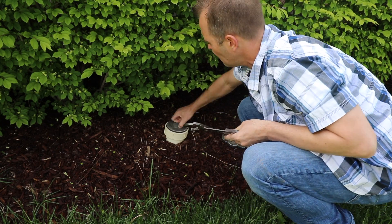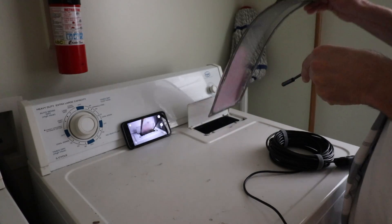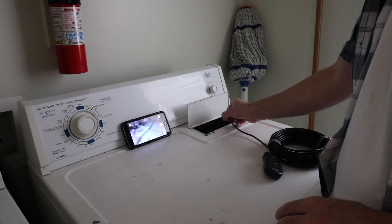This part works really well — it's a straight drop about 15 feet down to access the sewer line. If you see standing water at the bottom that means you have a blockage between here and the street; if not, it's between here and up into your house. This is raw sewage so you really want to sanitize the end of the camera once you get it back out. Inspecting down the dryer vent you can see if there's lint or any blockage. If you're going to shove this in appliances make sure it's unplugged because the end is metal and you could bridge circuits and fry boards.